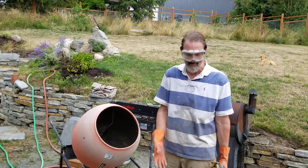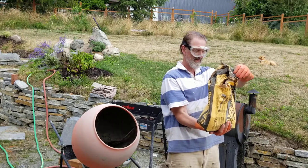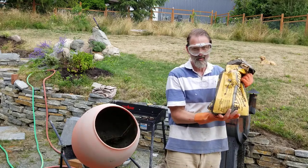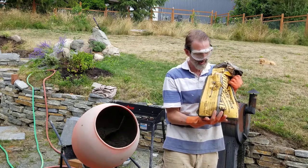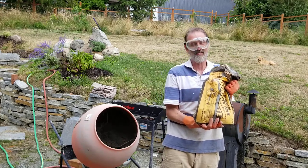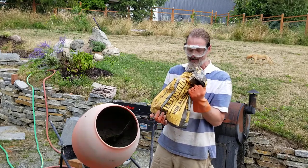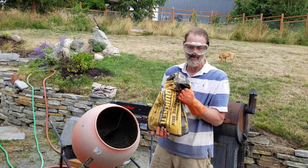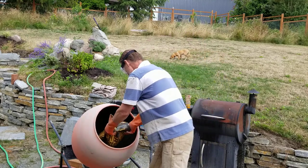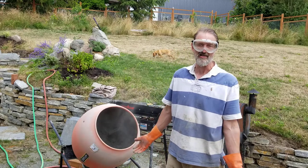I'm pouring footings for a house right now, and unless you're building a nuclear power plant and need to pay close attention to your water-mix ratio, just forget all that and do it the way I said: 11 and a half cups per 60-pound bag. Like all things you mix — epoxy, concrete, whatever — mixing a small amount is always a little trickier than mixing a larger amount because the properties tend to even out.